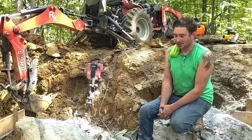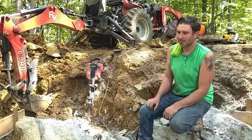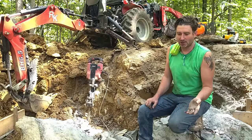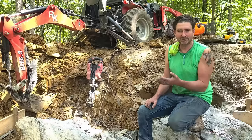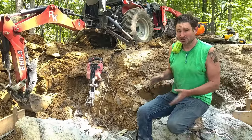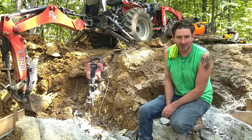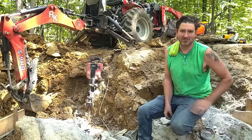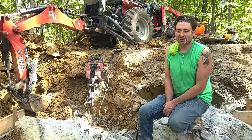Alright, well, that was a doozy, guys. The breaker hammer, it's good for demolition construction work. Like if you're breaking up a sidewalk or a patio, tile, stuff like that. Not for rock breaking, like what I'm using it for, but it can chip away, like chisel a little bit, if you have the strength to hold the thing the whole time. It's a 35-pound hammer, and it gets heavy after 10 minutes, and I just had like a 45-minute session. But anyway,